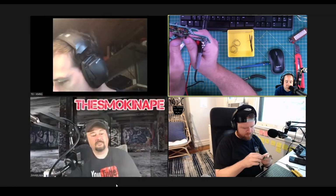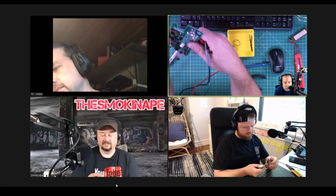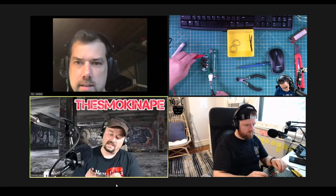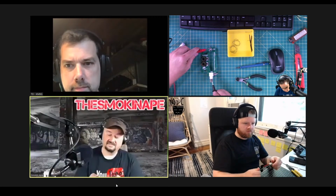If I want 40 meters, I push them all towards the BNC. Okay, I got to test that. Hang on. Pins to the left. Okay, that's good. That beeps. Now, if I want 20 meters, they all go towards the vertical wire. Correct. Okay, they're good. But if I want 30 meters, I got to push this one forward, and that one leaves there. So let me test that.